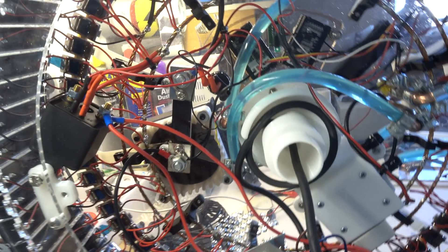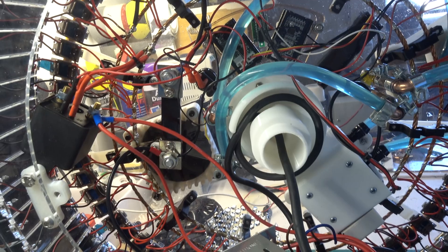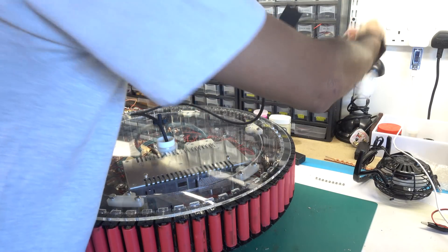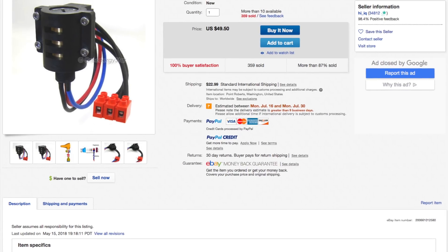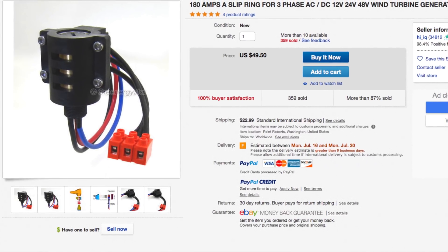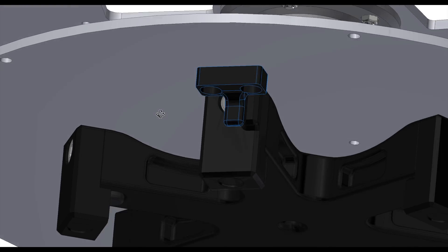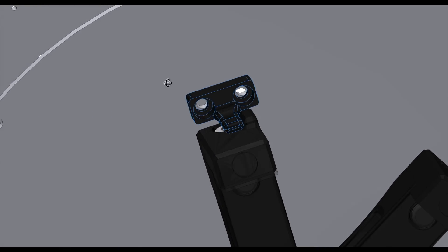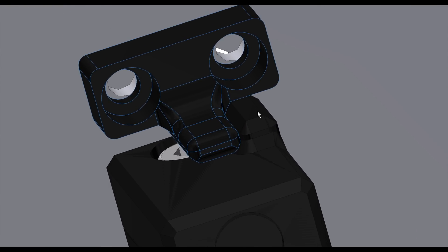Unfortunately this feature adds a level of complexity with all the working components and their respective wiring, as they need to be self-contained and the only output from the machine should be the power lead. Some of you have recommended using a slip ring but a 100 amp slip ring would not have been in the spirit of a DIY project and would have totally blown the budget. So I had to limit the rotation of the BFC to 360 degrees and figure out how to design a means of cable management from a single rotation.